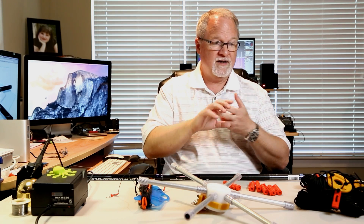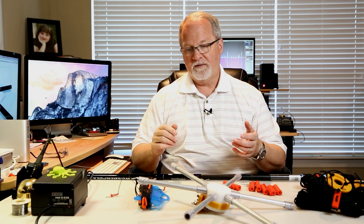That's a lot of commitment. Unlike a simple dipole where you just get it up in a tree and you're on the air, here you've got about 15 minutes of setup, and you need the hub, six spreaders, the wire kit, guy ropes, guy rings, stakes, mallet, and a base if you're by yourself. You have to decide whether this is worth it. It's definitely a great antenna — you get 4.4 dB of gain, which is less than one S unit. Of course, you're also hearing fewer stations on the side and rear. Building it isn't particularly hard, just kind of tedious and requires a little ingenuity. For many it won't be worth it, but because I like playing with this kind of stuff, I'm glad I did it.